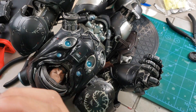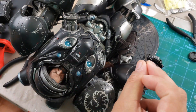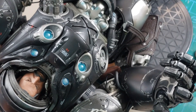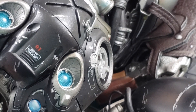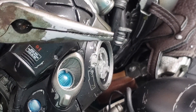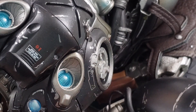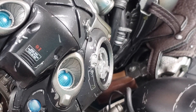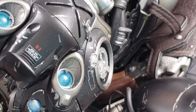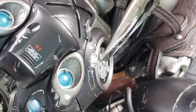So what I did — I took an M2 Allen wrench, the screw here is an M2, so I took it out. I pulled out the LED using a flat nose plier. Actually, there's glue there — I think it's an Elmer's glue or hot glue. What I did, I just pried it up. I used my Gundam nipper to pry up and take out the glue, and I pulled out the LED.